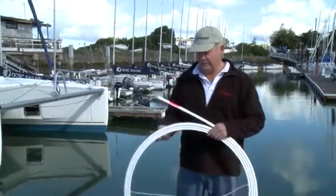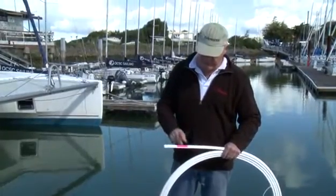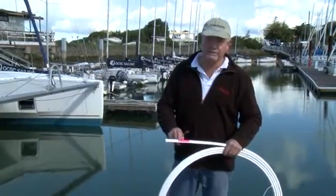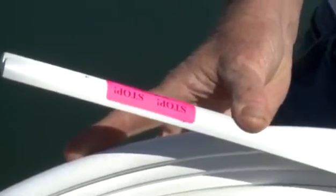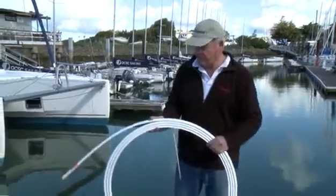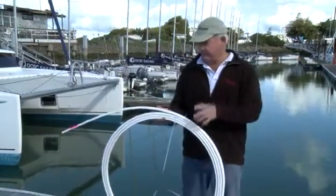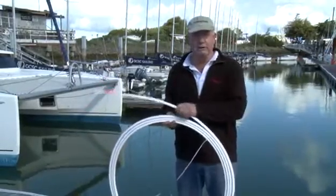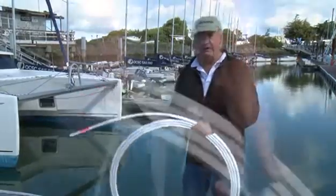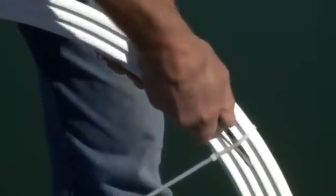A couple of cautions in this regard: the bottom of the back extrusion on the CF-500 is marked with a warning label that says 'don't cut here,' for obvious reasons. When you're unpacking these, they're tied up in a coil with tie wraps around them. You have to be very careful — because it is spring-loaded — that you control the release one snap at a time as you uncoil it and let it come back and rest on the dock so it loses its memory of being in a coil and lies in a straighter line.